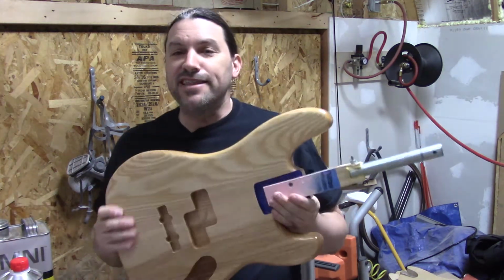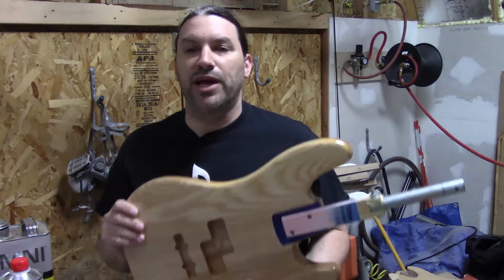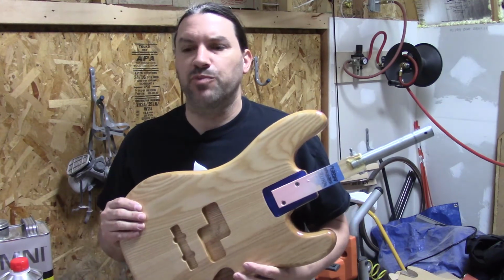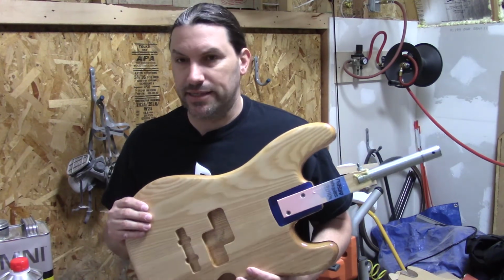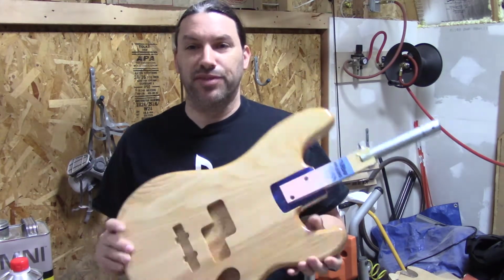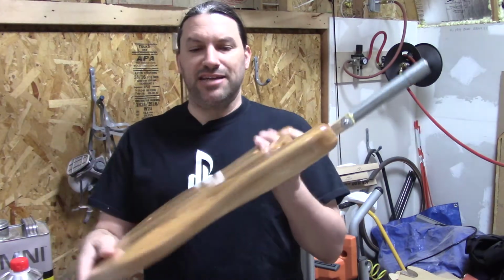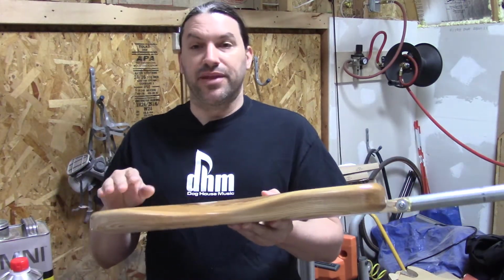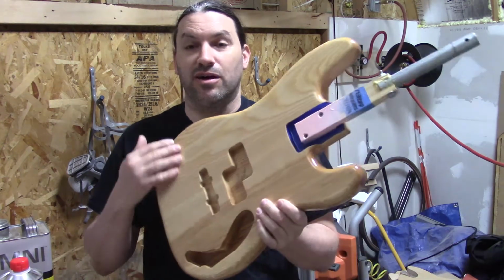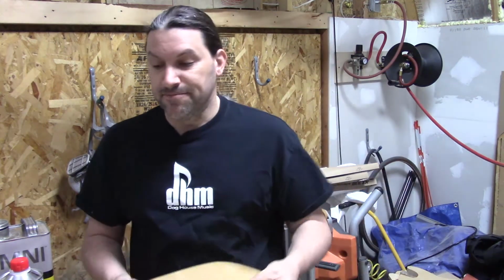Okay, we also said that in this video we were going to talk a little bit about the equipment that we use, specifically spray guns. I've been fielding a lot of questions on a couple of forums about spray guns, guys who are kind of wanting to get into this. And since I'm here out in the booth, here's a couple things we've been working on. This is a base, it's ash, and it's been sealed. And the cool thing about that Simtex sealer, guys, is there's no grain fill on this, so it's just straight sealer, and we'll go ahead and sand this back and it'll be smooth as glass.